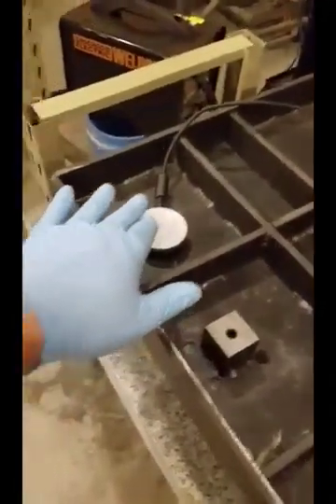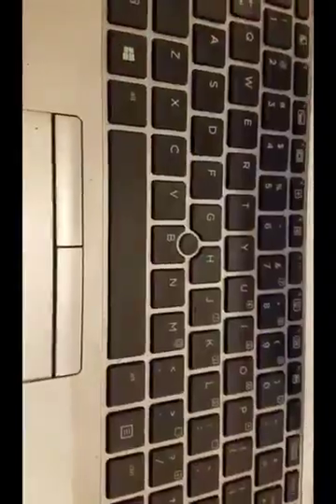This table, which is 32 by 18 inches and 3 inches thick, is balanced on a single 1-2-3 block underneath the middle. I found that's the best way to get vibration out of it — only suspend it in one place. When we did the table, we took an 8-ounce aluminum weight and dropped it 12 inches, repeatedly, until we collected about 10 samples of data. I've got the transducer going into an analog-to-digital converter — an Arduino — which plugs in via USB.